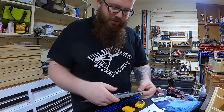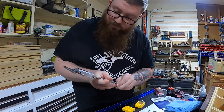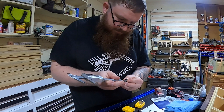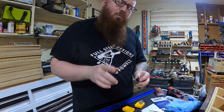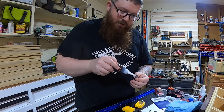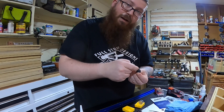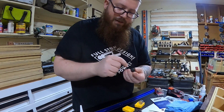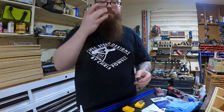I don't have a really good height gauge to measure these with, but I can use this caliper here. We're at about 87.40. Now let's check our V-bit — and I'm getting 87.40 on that one also. One other thing I like to do is apply a little bit of CA glue with some activator, or you can use green Loctite — the penetrating type. I recommend applying it on the upper side, not on the flat surface or the shaft, so you don't prevent it from going into your collet. Wipe up any drips. The penetrating Loctite takes about 24 hours to fully cure, so this may be something you want to do and come back the next day.